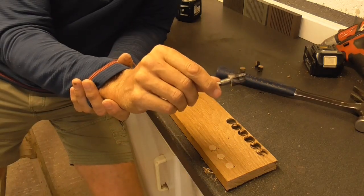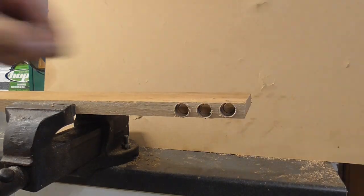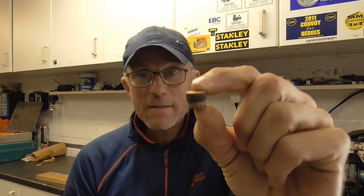So there you go — that's how I cut my plugs accurately. I know not everybody has a table saw, but that method could be easily adapted with a circular saw — you'd just cut them in strips. If you've only got one or two plugs to do, it might not be worth getting the table saw out, and you could just break them out as I showed earlier. But generally when I've got pelleting work to do, I want a few, so I run a load off and find them really easy to finish the work with. I hope you found this video interesting — thanks for watching.